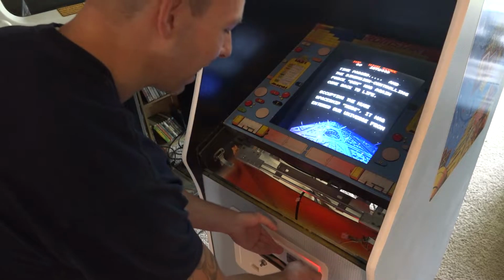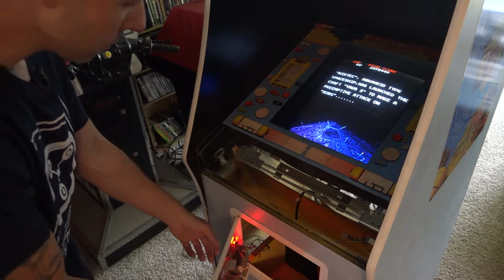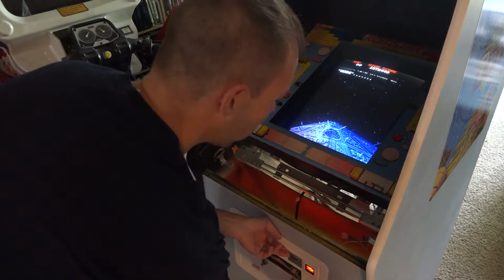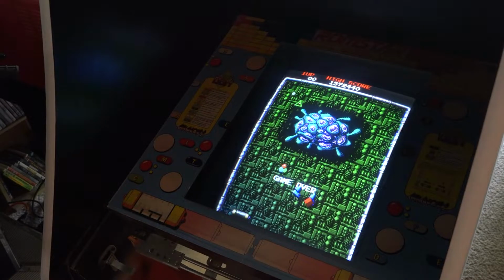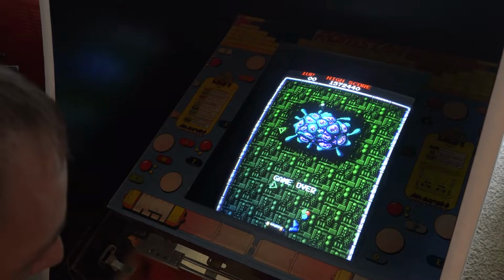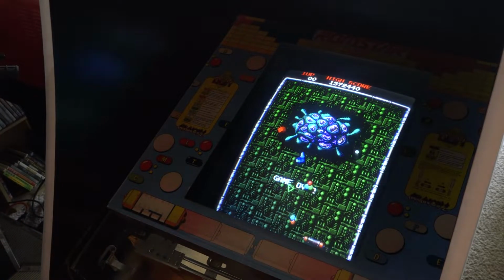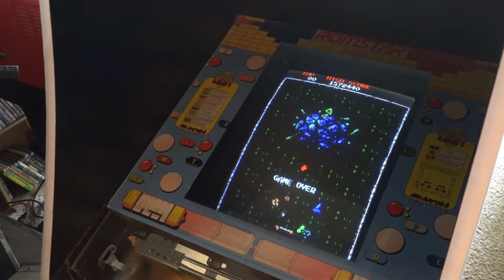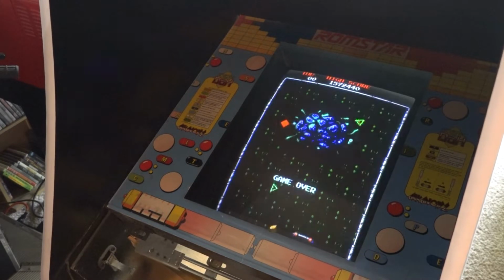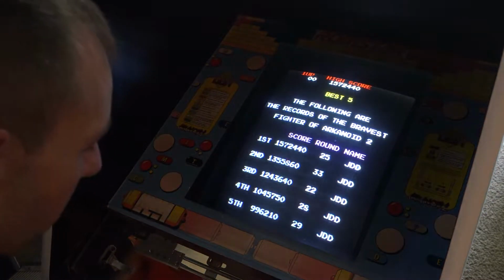And I've never seen anything like this before because there's no video cable down here. And actually, you know what? Let me show you this one more time, just a closer picture on the monitor here. So I'll just walk you through this one more time. All right, so I'm opening up the coin door, about a quarter, about half, about 3/4, and crapola. There's a very faint video signal, and it kind of comes back when I move the coin door all the way out, but it is so flaky, but it only happens with the coin door. Makes zero sense to me.